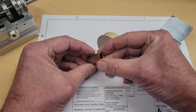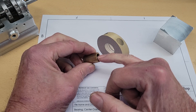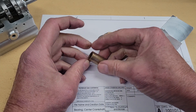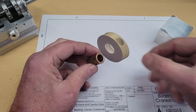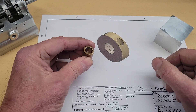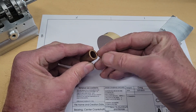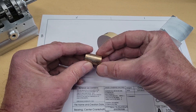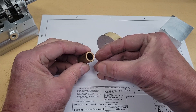It'll have a groove cut in the middle and an oil hole to deliver oil to our crankshaft. We're gonna make it from this block of aluminum and I'm gonna be using an off-the-shelf bronze bushing for the insert. This can also be made from a solid piece of bronze turned down. This particular bushing is a 7/16" ID which will be reamed to a half inch when we're done. If you use a bushing like this, I recommend using a cast bronze bushing. This one is a sintered bronze bushing — made from small bronze particles pressed together under heat and pressure. It doesn't machine very well; it tends to crumble while you're machining it. That's why a cast bronze bushing would be better.